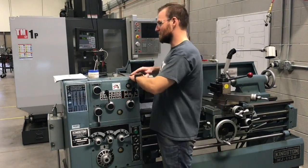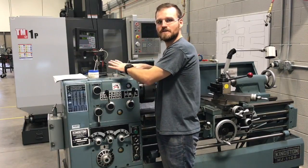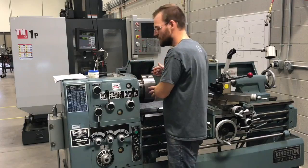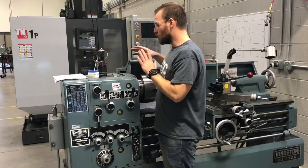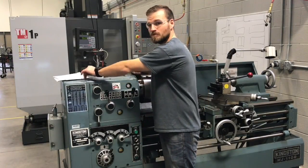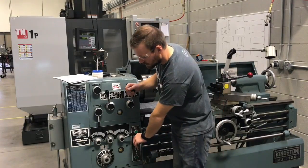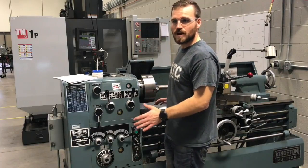The flat spot on top of the headstock is not a place to put a major amount of tools. We could create a pile of tools or extra bits and pieces of metal that could fall into the chuck. As a rule, we want to make sure that we only have our calipers up there, our oil, maybe the plans we're working on, and our chuck key. Lastly, when you walk away from this lathe, flip the off switch and make sure that everything has stopped rotating and it is a completely safe environment before you walk away.